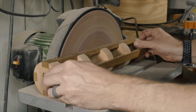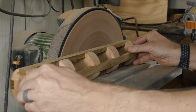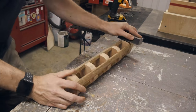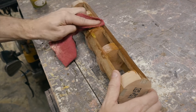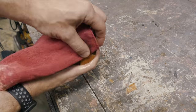I wiped off as much glue from the inside as I could before it dried — that made it a lot easier. After this was drying out of the clamps, I took it to the sander to try to smooth out those strips. They were a little bit proud in some places, again because of the issue I mentioned earlier. I finished up by going over the whole thing with a fine sanding pad. For finishing, I used a combination of beeswax and mineral oil, but you could use anything that's food safe — anything you would use on a cutting board would work great here.